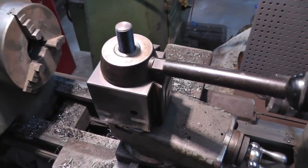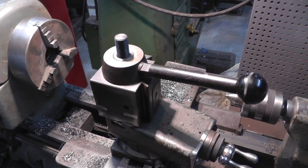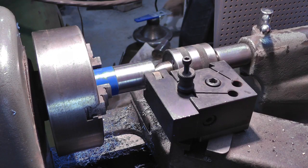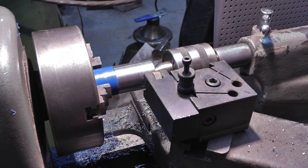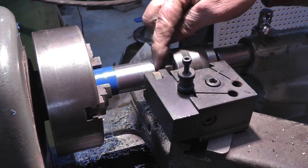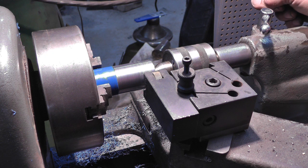And it'll drop right on there. So next I got to make that knurled nut for the adjustment. Okay, I'm going to attempt to make these pieces. I got a piece of stock in the lathe and took a skim coat off it and faced off the end. Got the knurling tool set up.